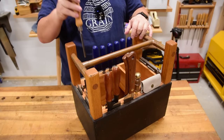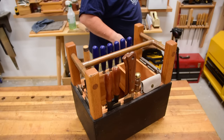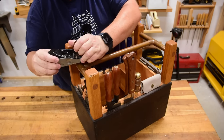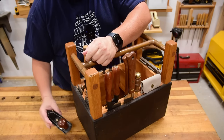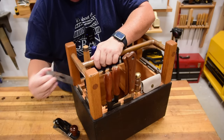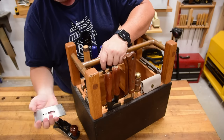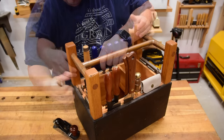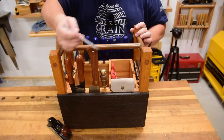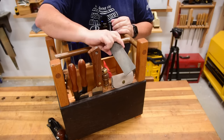There's a catch-all area on one side. I have all my chisels — all the sizes that came with the basic kit plus one mortising chisel. On this side I have replacement blades, because the planes I use are Lee Valley ones that sell alternative blades with different angles. I can have a high or low angle for smoothing different kinds of woods. They even come with toothing blades, which are really useful in highly figured wood when roughing sizes — prevents pretty rough tear-out. I also carried slots for rulers, pins, and a compass.